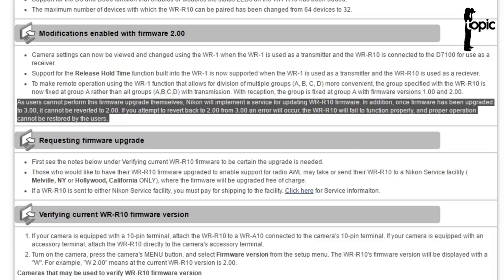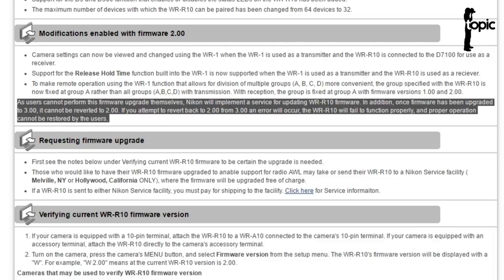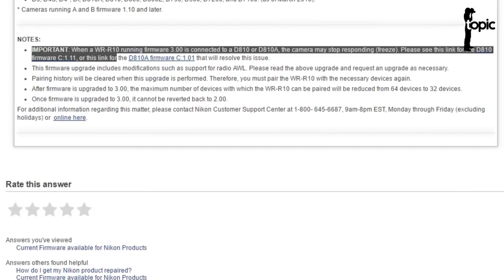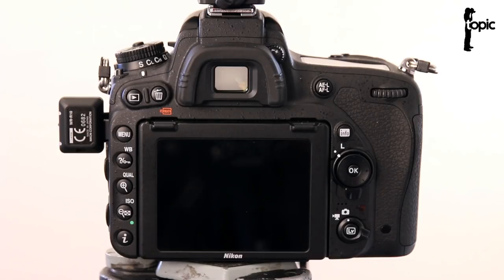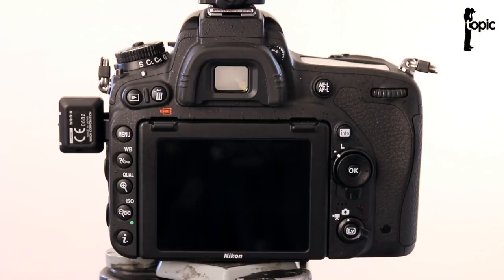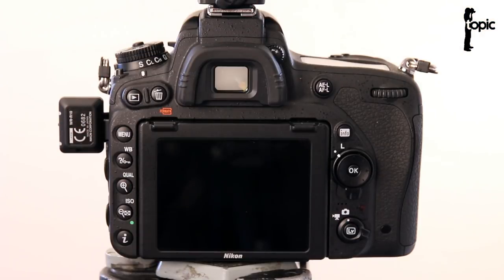I really hope this will be a free service, but I guess there's only one way to find out. Also worth noting: once you have firmware version 3 installed in this little dongle, it will cause issues on some older cameras like the D810, so you'll need to make sure that firmware is upgraded on those cameras as well. Just remember, that's if you want to use this WR-R10 as a normal remote transceiver — it won't work to trigger the flashes wirelessly without the update.